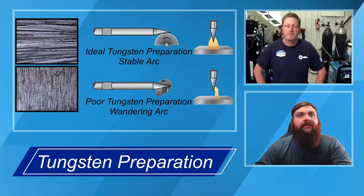We'll come back to the booth in just a second, but Robert has a question: what angle do we use in our tungsten? Once we learn what direction to sharpen that point, we need to talk about what difference the angle makes. An instinctive thought is that a nice big steep taper will give you a smaller weld puddle — but that's actually the opposite of what we see. The arc comes off from the tungsten at about a 90-degree angle, so as current flows down the tungsten, it doesn't make it quite all the way to the bottom.